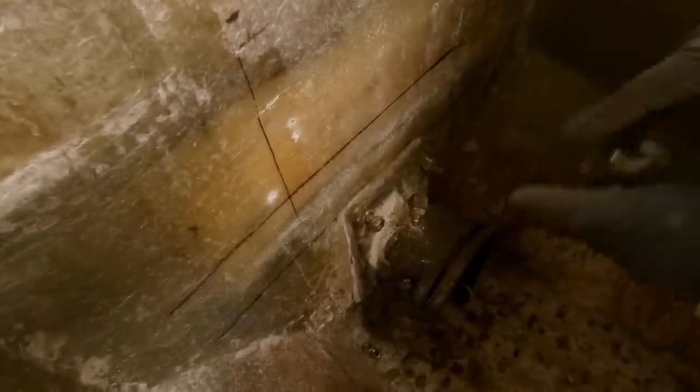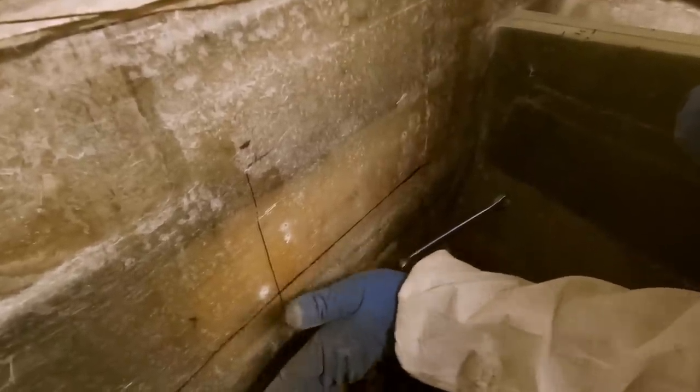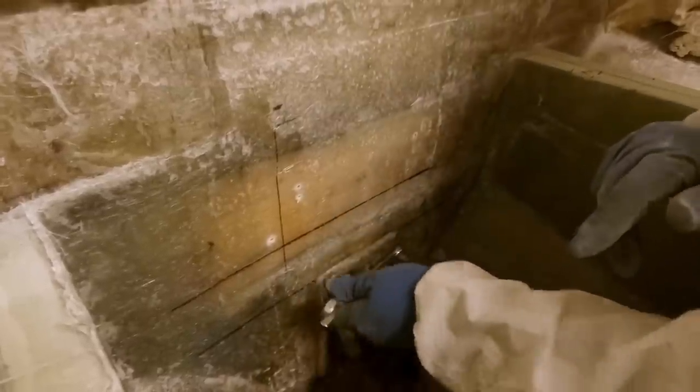Our goal here is to remove this, build up this glass right here on the face - solid glass - to get a nice good surface for this to go back up against. In the event that we ever replace this bulkhead, we can remove all that material right up to this fresh layer of glass we've made and then build it back again on the outside. Plus we've gone through this whole running gear assembly, so it would make no sense not to come in here, remove this, and at the very least repack it and make sure it's sealed well.